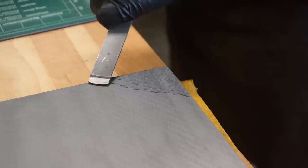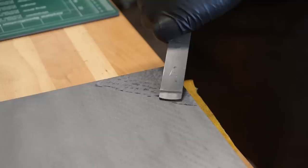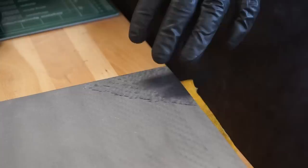And so it's really about, and guys, I do not hand scrape that much anymore. I did for a couple of years, and I'm a lazy power scraper user now. So a couple of things to note here. My cuts are too close technically. If I was a machine and I could dial it in, there should be a little more spacing between them, because I'm past the roughing stage on this. We're assuming that we're in that intermediate period where we're trying to get to finishing with high point count.